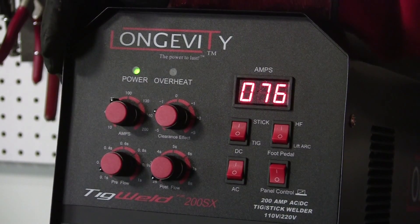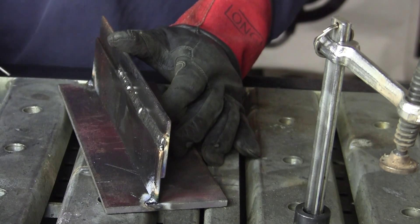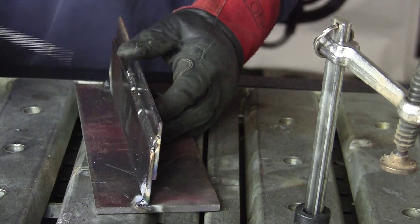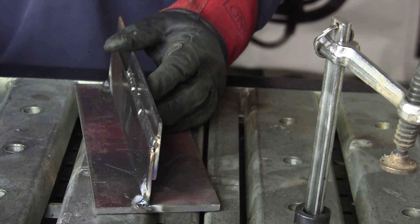So let's go ahead and tack something up. Now we're going to do the fillet weld. What we're going to do here — it's a T shape, like I had on the board — and we're just going to run our bead across here on the seam. I get the arc set up and I'm going to drag the rod, making sure the puddle flows up into both sides. You've got to watch out for undercut — that's when the amperage and the volts come in. Just watch that puddle. Don't push the rod in too far; you want to keep that arc fairly constant. Depending on the rod you're using — I'm using a 6010 — you want to whip it back and forth, just like you're stacking coins. Watch that fill in, then go to the next whip. Fill in, then the next whip.